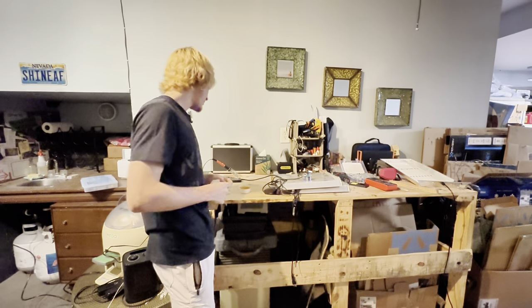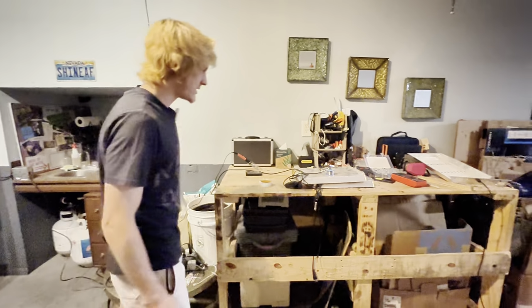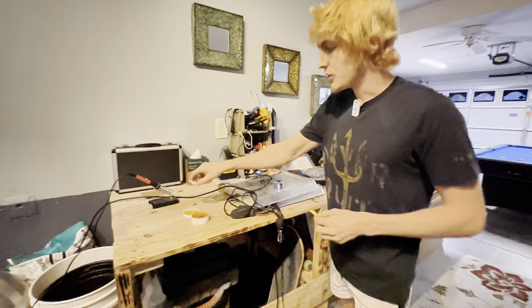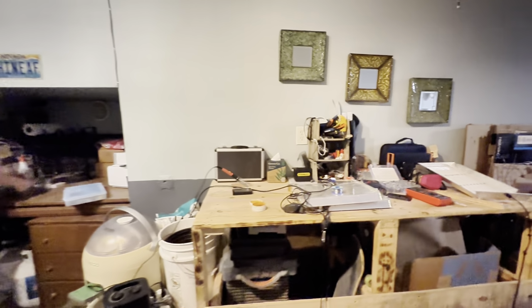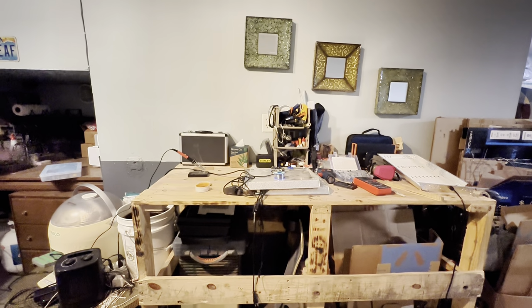Try to be very safe with it. It's got a short wire, so make sure in your work area there's not going to be a whole lot of moving around and stuff. So we're going to let that heat up, and we keep a little wet sponge underneath the stand. We don't want to breathe in that flux either, so I'm going to throw a mask on, but the mask ruins the microphone, so I won't be able to talk effectively with the microphone.